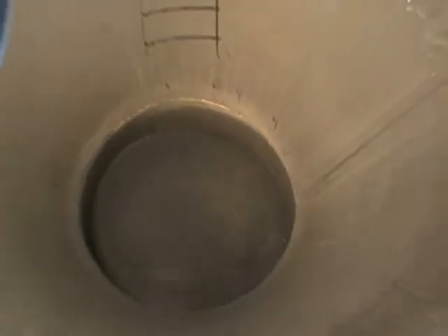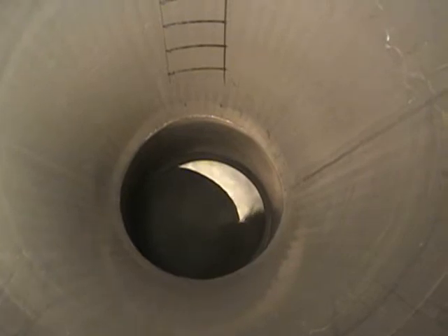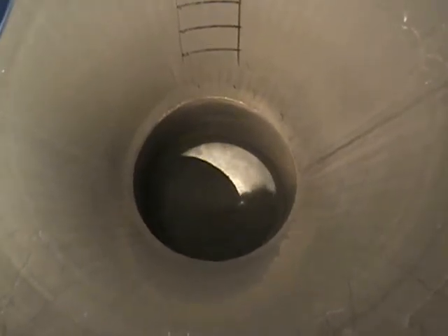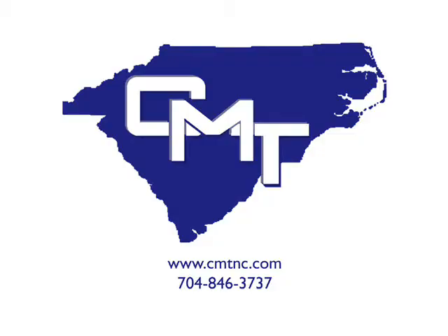Now we're in the complete straight section at the bottom. Next we'll start to see the top plate of the feed tray. It's actually an orbital action — it has to do with the center drive we use, which is orbital. It's just going to come off the top tray, and then all that will be left will be in the bottom tray itself. This is very light material — 13 pounds per cubic foot — and you can see the dust that's occurring here.